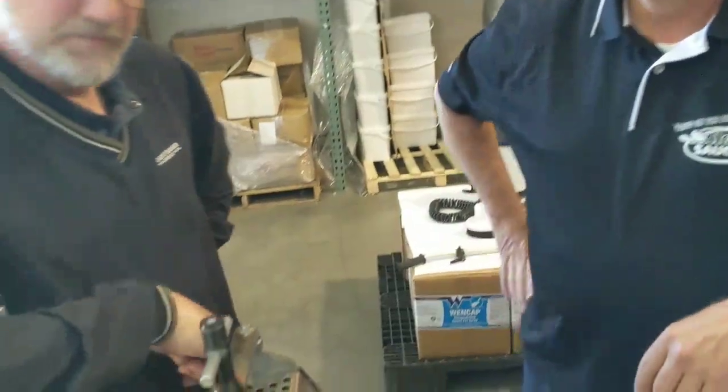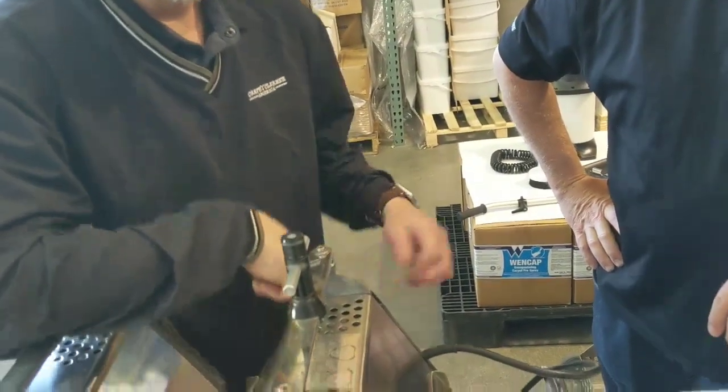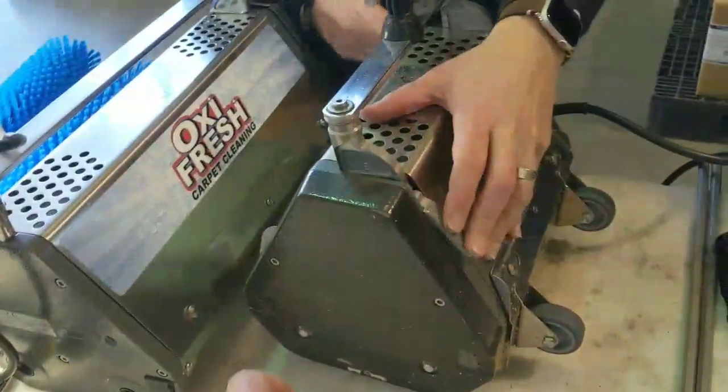If you do it right, you'll never have to replace it — I've had that one for nine years and it was never a weak point. Also, lift the machine up a little bit, especially on thicker piles. If there's a lot of weight on the machine, it's not going to want to spin. Some people lift it up, some people cock it to the side. These TM units are a little less powerful than our Pros as far as engine torque, so on thicker carpets you'll see a little more strain — a lot of guys tip it or lift up on the handle.